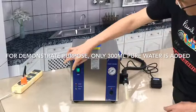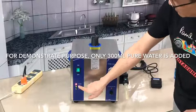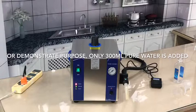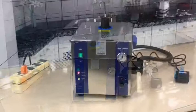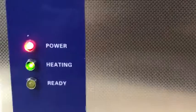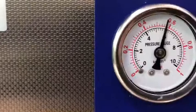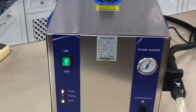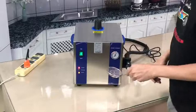The second step is to press on. You will see the pressure is 0.7 bar, power is on, and heating is on. When heating reaches ready, the steam is full. The pressure reaches up to 6 bar — just between 5 and 6 bar — and the machine works to always keep the balance of temperature.